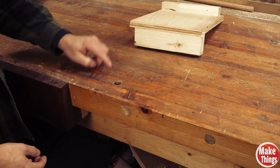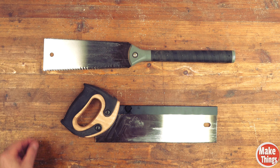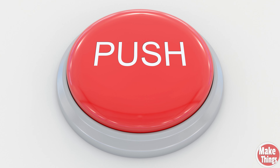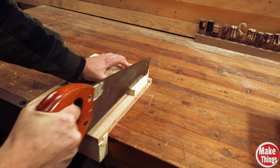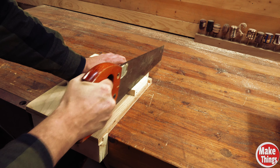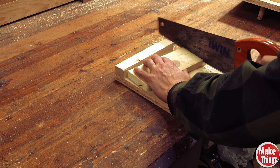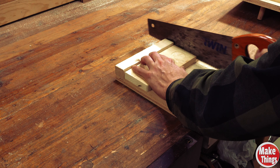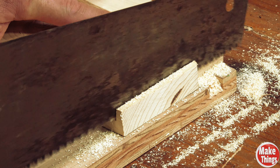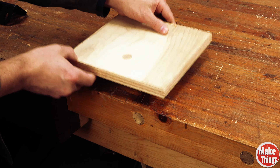Japanese pull saws work in a pulling motion — I can put all my energy against the stock, but I'm working against physics. So I came up with a different take: instead of using the edge of the bench, I looked at using a three-quarter inch hole to keep my hook from moving. This means I can use either a push or pull saw without having to worry about the force needed to keep the jig on the table.